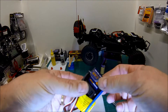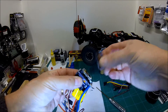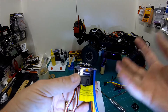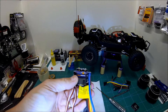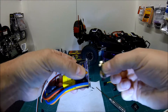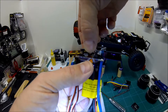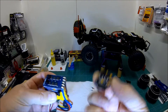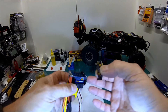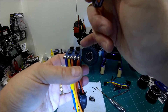Anyway, if you want to do this, here's what you do. I am on a mission to get my SCX10 completely waterproofed so I can go through water whenever I want. Generally I'll just be going through puddles, but if I need to ford a stream, I can do that. So here is this Hobbyking ESC — I've undone the four bolts that hold the heat sink on and the bottom case off. Be careful when touching these boards; if you've been walking on carpet you might be electrostatically charged, so earth yourself on something metal. With the daughter board removed, you can see the power MOSFETs here — these need to be covered.